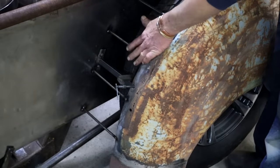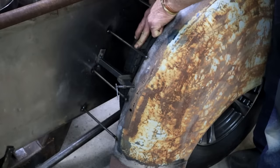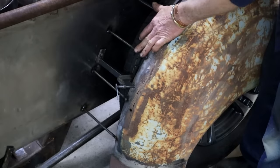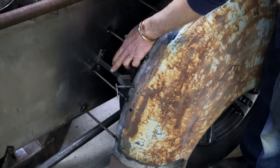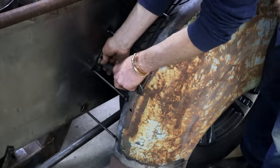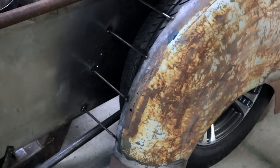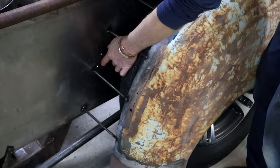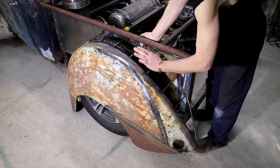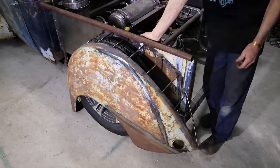Here we go, like this. So I've used 8mm 5/16 round bar, because that's what I had on my shelf. 6mm 1/4 inch would be just as good. So let me remove my temporary support here, because now it should stay very well where it needs to be. Yes, man. I'll just weld up these holes at some stage. So we got a nice sturdy framework here now. All we got to do is fill in the blanks.